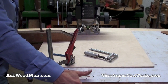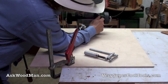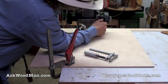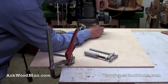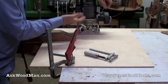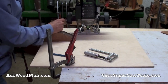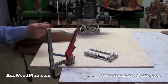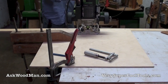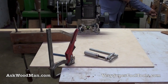So I'm at a solid three quarters, and I'm going to go 21 millimeters — that ought to be enough. As I get down toward the post, I'm going to keep plunging and coming up, plunging and coming up, so I can free and evacuate those chips. That way I won't get overheated and it's not going to glaze the inside of my hole too much. And I don't want to bust through the bottom either — I don't want to make a big mess and bust through.